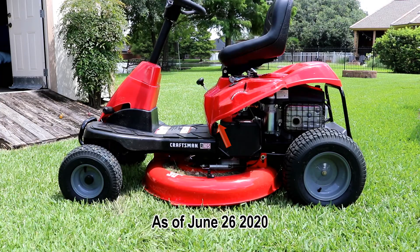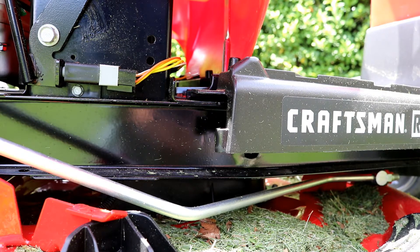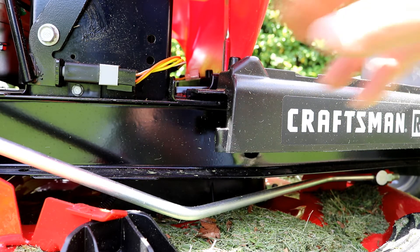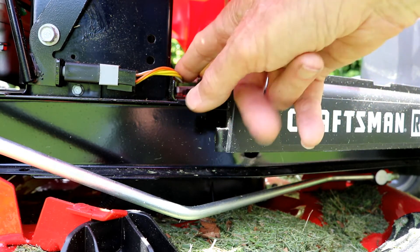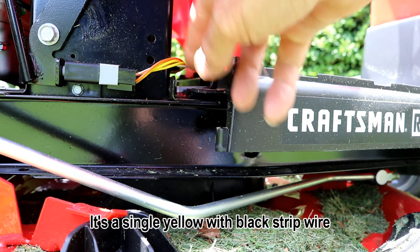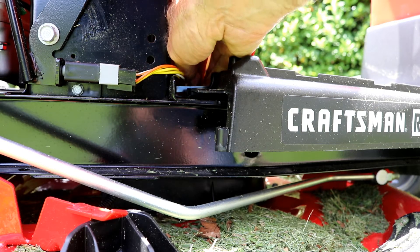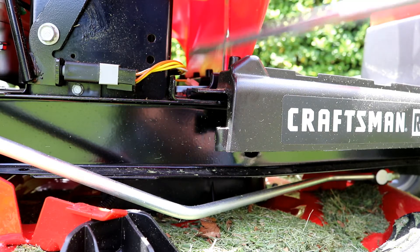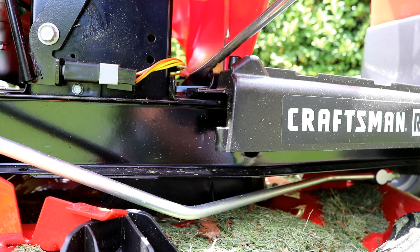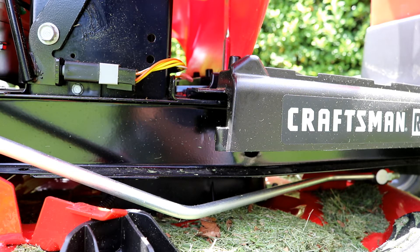On this particular model, the wire in question is right here — you can see I've got it unplugged. It's a yellow wire; specifically it looks like black and yellow stripes. I've seen some people unplug a big harness and that might work too, but this is the one. It's hard to get to from this side. You can see where it plugs in right here — if you're strong enough you can pull it up. Let me point with the screwdriver: it just plugs in right down underneath this connector, right there. That single plug controls your blade operation in reverse.